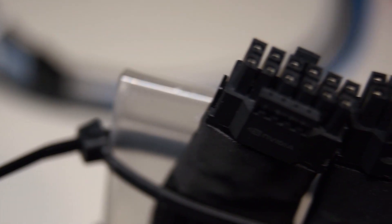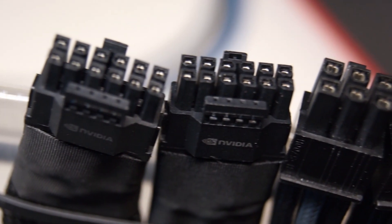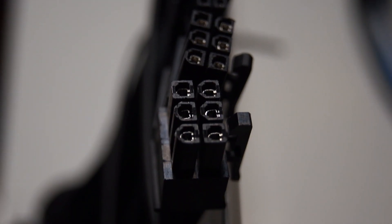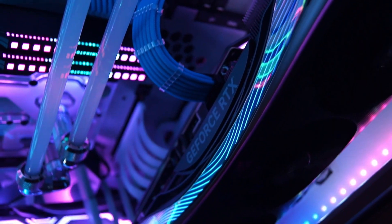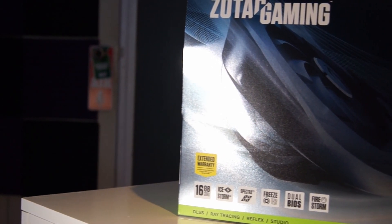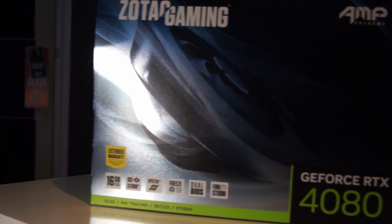Looking at the new design and pictures coming out, there is an obvious issue with the connector itself, and Intel, PCI-SIG, and Nvidia all know this. Companies do make revisions, so it's not super unusual, but it's clear that something's up. One ongoing problem I see is just the size of the connector — and there seem to be some really strange tolerance differences between manufacturers. For example, a Zotac 4080 I had here was very hard to push the cable into, whereas my 4090 Founders Edition can pop out with very little force.